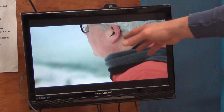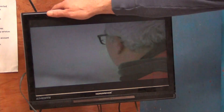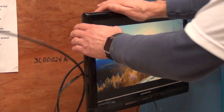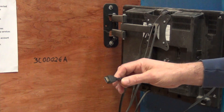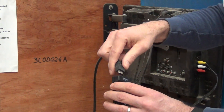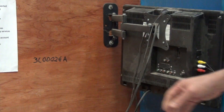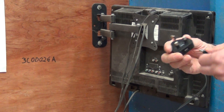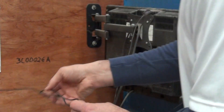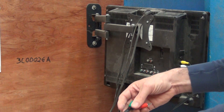So what I have here is a combo box running directly over with a HDMI input on it. Imagine the situation where that HDMI port has already been used by another device. So I'm going to pull out the HDMI lead and convert around — pushing this in here to convert it over. This little light lights up but it's not sufficient to reliably power it, so I'm simply going to plug in this little phone charger — a 5 volt 2 amp output — directly into the side port. And now it's powered properly.